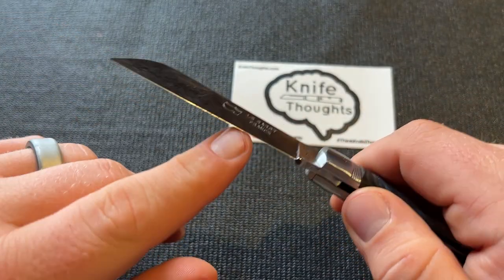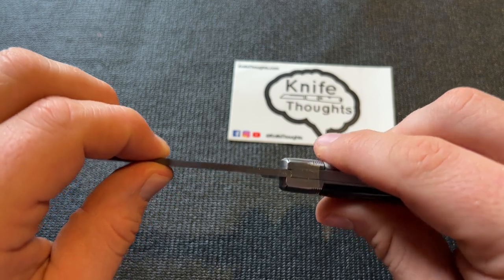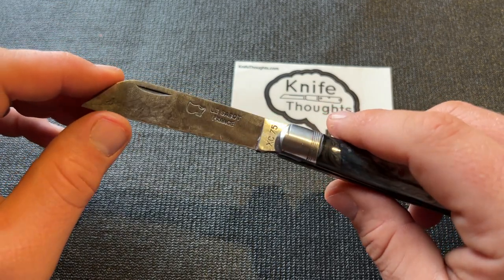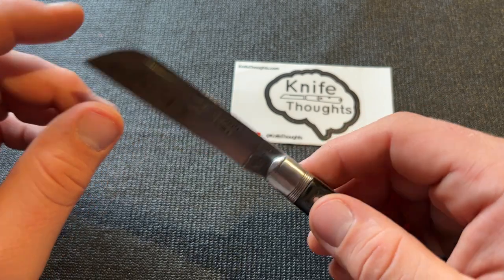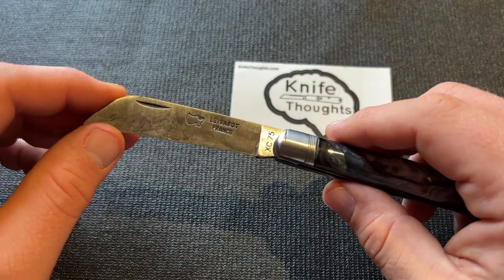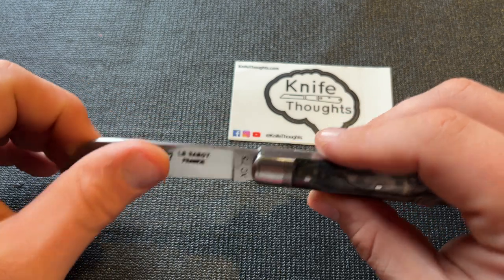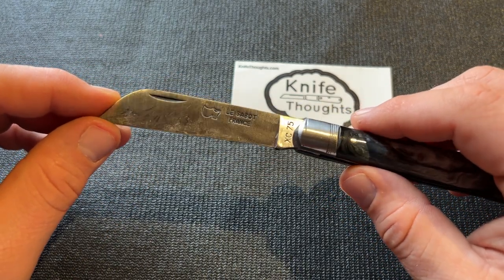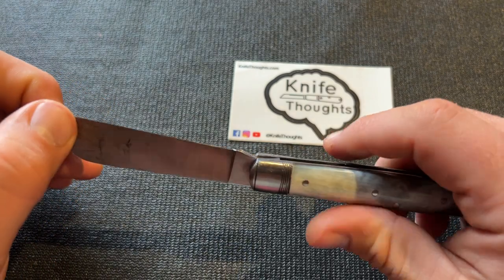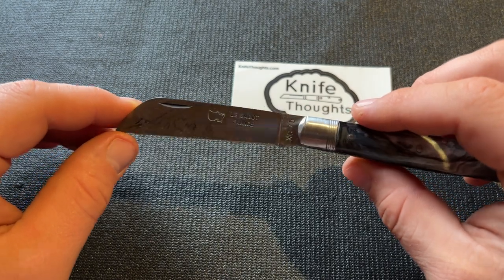I've used this knife a lot and it works really well. It cuts well, is ground really well for cutting, and slices really nicely. It's really solid and didn't develop any blade play with some relatively hard use for a slip joint — because it is made to be used, a worker's knife or farmer's knife. The steel is XC75, kind of like an equivalent of 1075. Not a high-end steel — no carbides, not even iron carbides like 1095 — but it's a carbon steel that works well, is easy to sharpen, and should be relatively tough. With a good heat treat, which I believe they do in-house, it should hold an edge really well. I didn't even sharpen it; it hasn't really needed it.